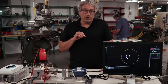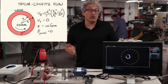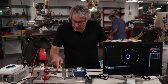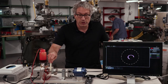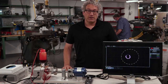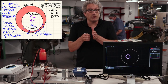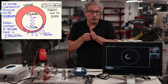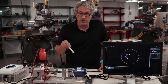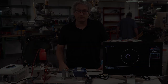A journal bearing is in many ways the simplest possible bearing — just a shaft inside a housing — but it carries the largest loads and lasts the longest because it prevents solid-solid contact. If it didn't have to bear a load, a rotating cylinder inside a housing would be described by Taylor-Couette flow, which we can solve analytically and which has no pressure gradient. But any real bearing must bear a load, so the journal comes to an eccentric equilibrium: as it moves closer to one wall, a stabilizing pressure forms from the oil being compressed through a narrow crevice, holding against both direct radial loads and cyclic loads from a rotating asymmetric weight.